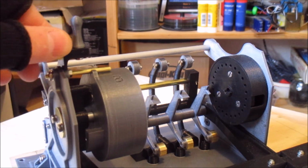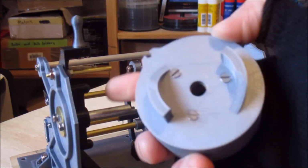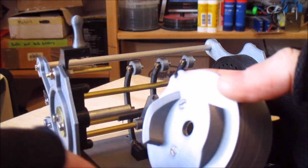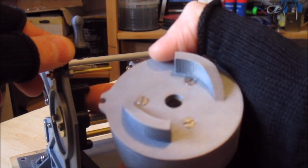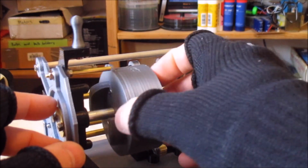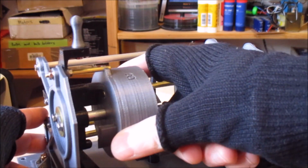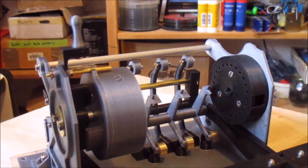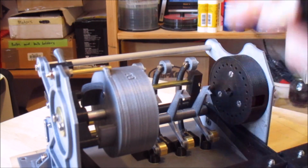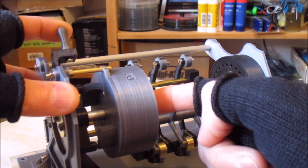If we move the little lever, you'll be able to see how the reflector just comes out completely. Has the little ramps on the back of it. These bits here, that these little bumps on the lever push against. So the reflector slides in there. This little bar just stops it from rotating. So it fits in there. So that can slide backwards and forwards, but it can't rotate. And you can see as the lever moves forwards, it pushes this forward, and it also brings these forwards to engage in the edge of the rotor. So you can see as it comes back, they go back.